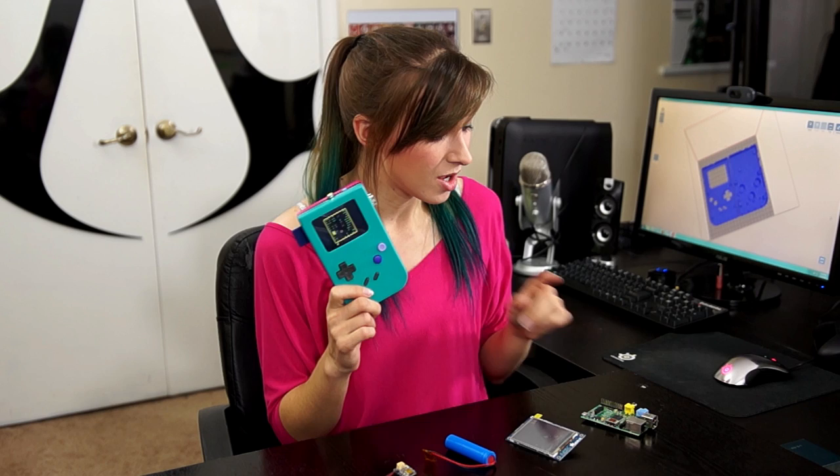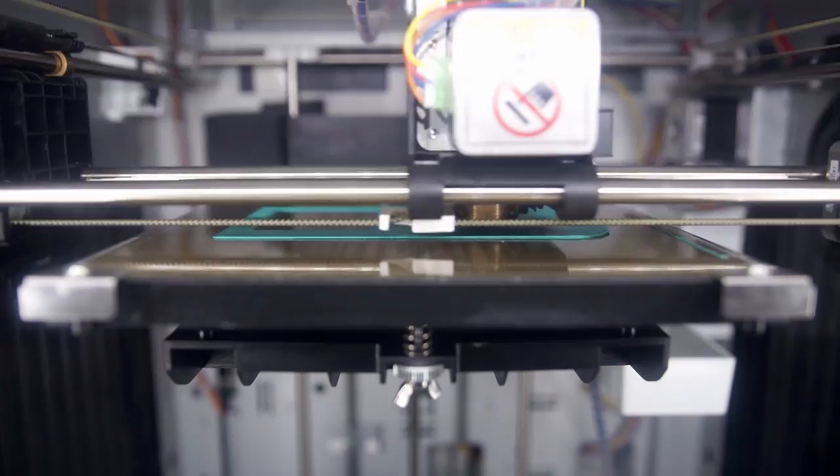Here's the finished emulator that I'll be giving away. Adafruit refers to this as a Pi Boy or Pi Girl, and you can make one yourself by following the tutorial on Adafruit.com. The big things you'll need are a 3D printed Pi Boy case, a Raspberry Pi Model B, a touchscreen display, a LiPo battery, and a charger. The buttons and D-pad come from a hacked Super Nintendo controller.